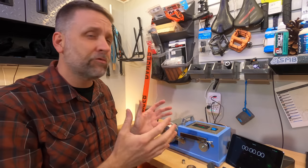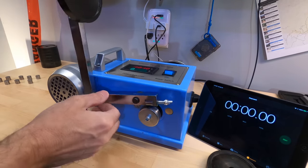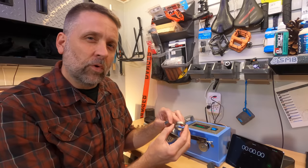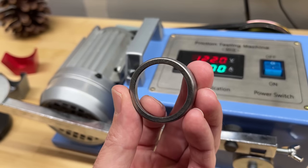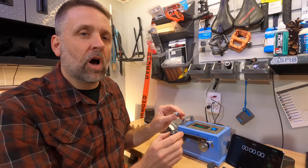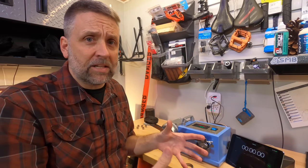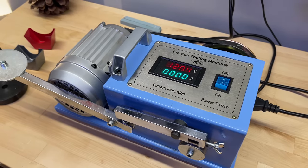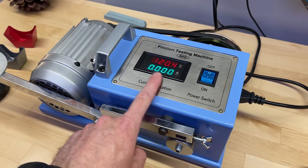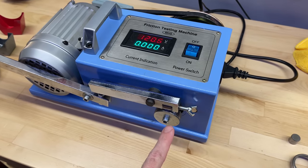The first test I'm going to do is a friction or wear test. A metal cylinder is captured within this arm and it is forced to run against this metal wheel. This metal wheel is of a hardness greater than the metal cylinder, so as it turns against the cylinder it will cause wear. We'll put lubricant in this cup — it's magnetized behind the wheel and the wheel is submerged in lubricant. The lubricant that provides the best wear protection will have the smallest wear scar. I'm also going to be watching this digital ammeter in green very closely because a low value here indicates that the motor is working less hard to overcome friction at the wheel.